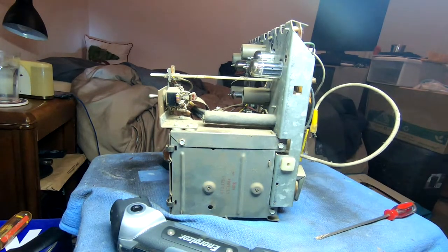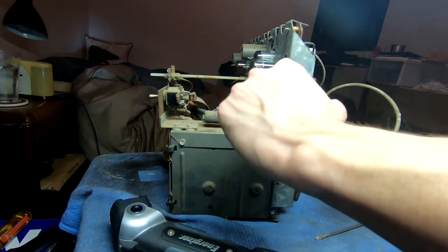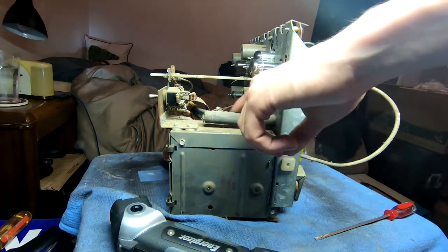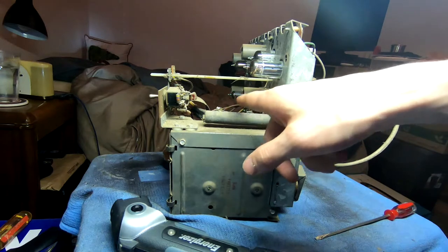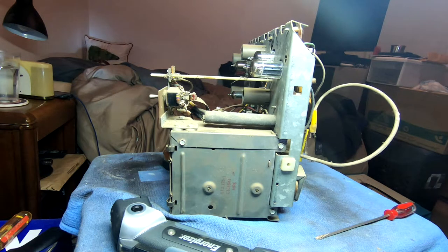That wire wound right there. I'm not quite sure what the... No, on the schematic, let's see, what is that? 63 ohms? 53 ohms. Yeah, I did see that on there. The power supply, I believe, relies on a pretty basic voltage drop resistor to give the 115 volt DC supply from the 130 volt rectified. And then it has a single electrolytic capacitor on there for filtering.